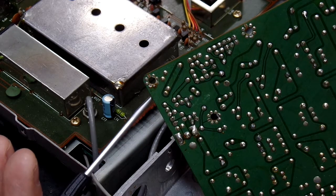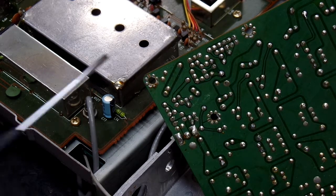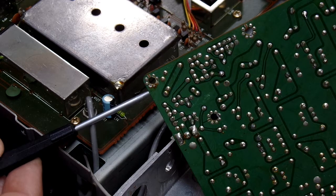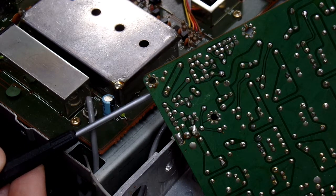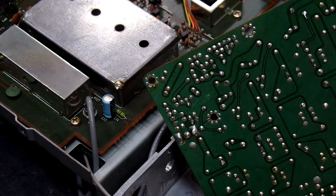If I wiggle it on the back side it's very loose - it's freestanding. As soon as I desoldered it from the connector we could clearly see the cold solder joint. So I'm going to go ahead and make that repair, and I have a high level of confidence that it will fix the issues with receiving.